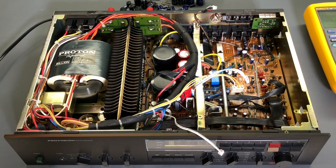I'm ready to turn on the unit and see if it powers up. I'll switch on my isolation transformer. I have a very light-duty fuse so if there's a problem that fuse will just blow. Alright, looks good so far — there's a little click there. That's the protection relay clicking, which is a good sign. You can see we have some indicator lights on the front. Right now it's drawing roughly 15 watts, which is very reasonable just to idle at.